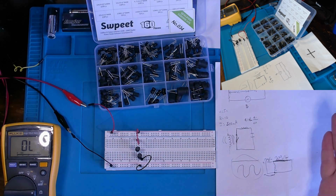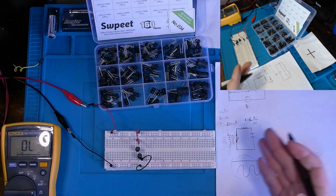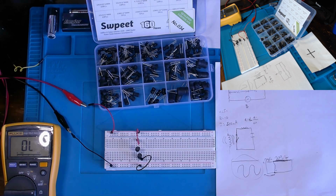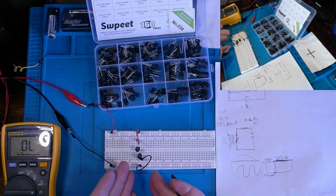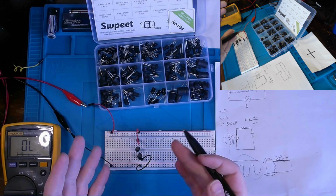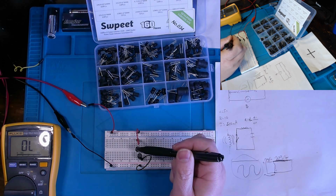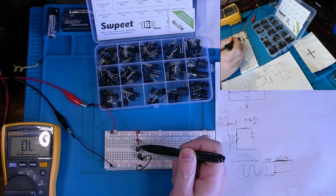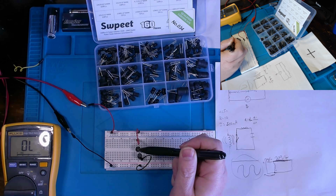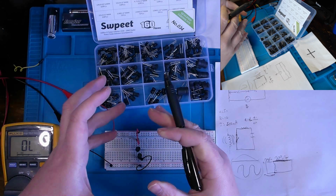Now, if we are applying direct current to a circuit containing inductors only, then in that case the inductor will simply behave as a short circuit. In the ideal case, an inductor is considered a resistance-free component, but in application a lot of times that's simply not true. That is because in practice it must contain the resistance of the wire out of which the inductor is formed, i.e. that enameled copper wire that's spun around the ferrite core in the center of what builds this component.